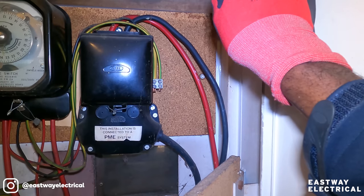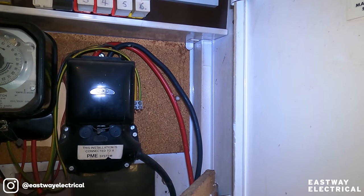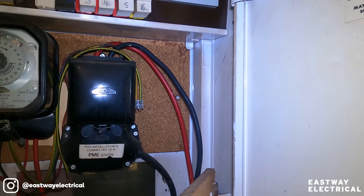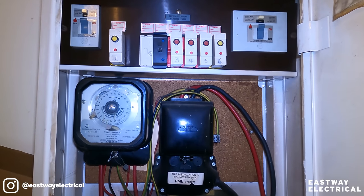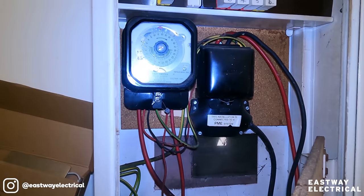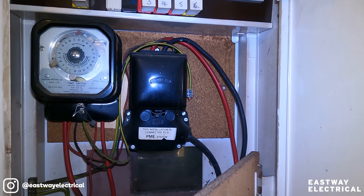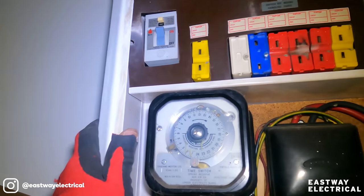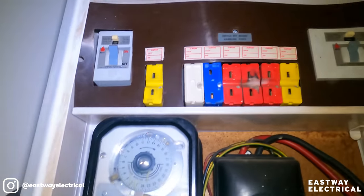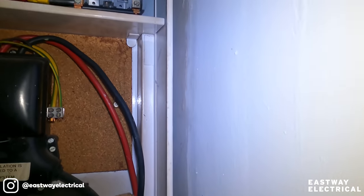What I'm going to do now is test this earth leakage circuit breaker to see what it's tripping at. I'm thinking - is an earth leakage circuit breaker slightly different to an RCD? They used to be called earth leakage circuit breakers and now they're called RCDs, but I'm not sure if there's a slight difference. I'll do a ramp test to see what it trips at. I was trying to get this cover off - I'm going to have to take the frame off. There's no easy access to the screws on one side.